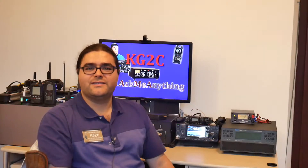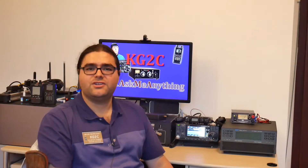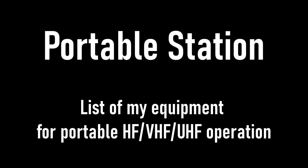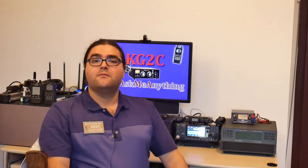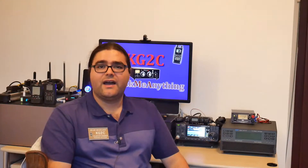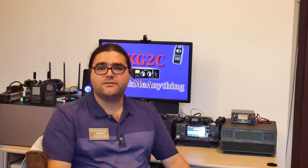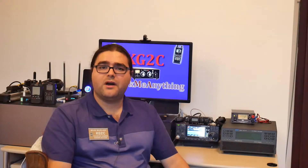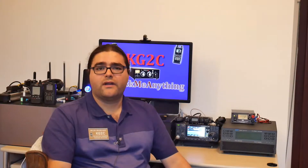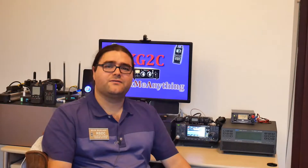Hello, I'm KiloGolf2Charlie, also licensed as LZ1AMA, and today I'm going to show you my portable radio station which I use for HF, VHF and UHF. Before I set up this HF station here, I used to operate portable activating parks using my ICOM 7100, which is a great HF, VHF and UHF radio when paired with the right antennas. I have a VHF/UHF antenna mounted on my car and also a vertical antenna for HF which I use with the tuner. The radio can go on working at 100 watts for about 5 or 6 hours at least before I run out of battery, and I can extend that even longer using solar panels which I also carry in my car, but that's a topic for another video.